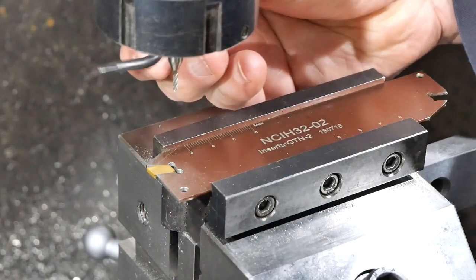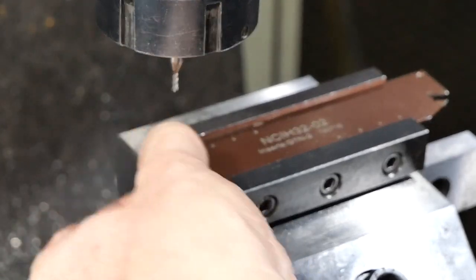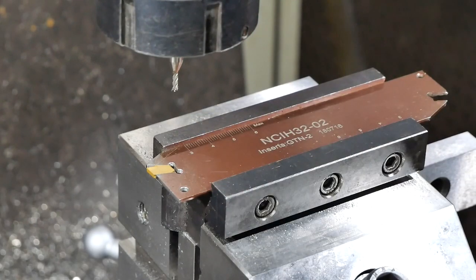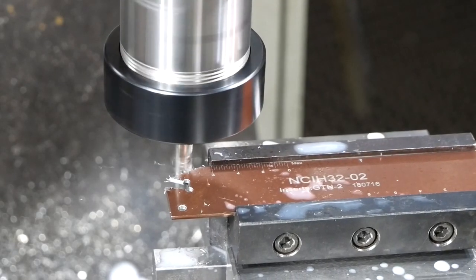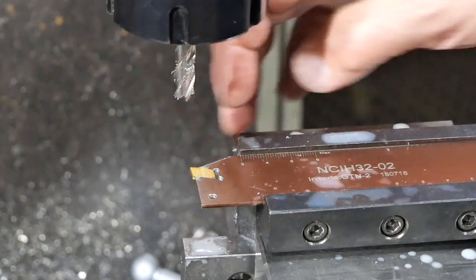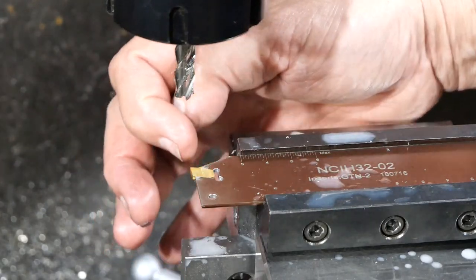Well, I think that'll do - it just has to be enough room to get the little livery thing in there. I actually think I've done enough there. The angle of the back is certainly not critical, so we'll leave well alone with that and then get ready to cut this piece off across the top - ouch, that's sharp. I want to go just a hair further and I'll do it cutting from this end. I had to switch to a smaller diameter cutter to finish this off because I was running out of room back in the corner here.